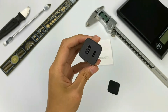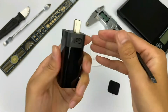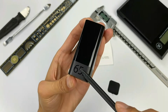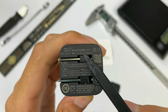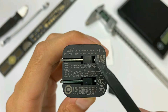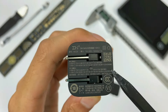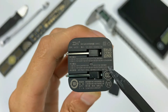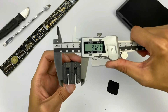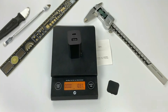The charger is entirely black. It has USB-A, USB-C, and adopts foldable pins. The upper side is glossy and the lower side is matte. We can also see the 65W and GaN marks here. On the pin side, it supports 100 to 240V, 50 or 60Hz wide voltage input, and 1.7A current — meaning we can use it in most countries and regions around the world. Length, width, and height are about 72mm, 31mm, and 31mm. Weight is about 104g.